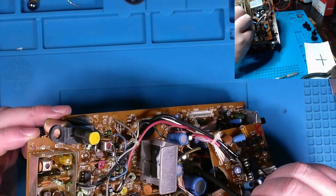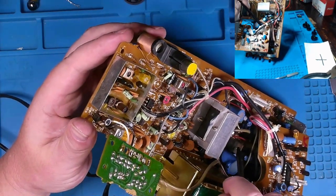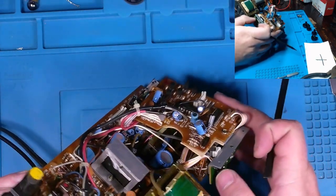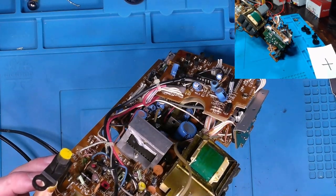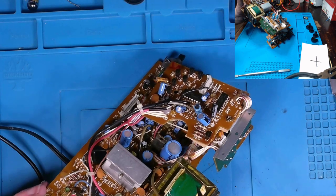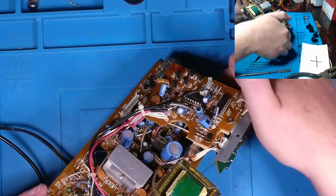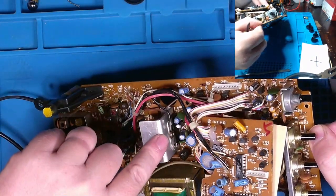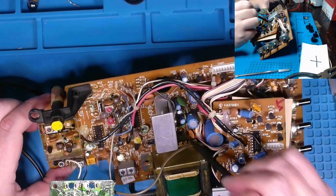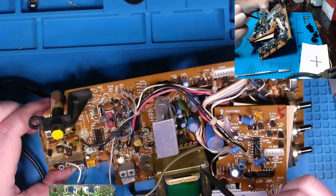Here goes a B507. I believe that is going to be a PNP transistor sitting right down in here. Let me see if I can get this without a shadow on it. Can I get a light over this guy a little bit better? Maybe not. There we go. Angled right now. There goes that one transistor. Like I said, this entire IC sitting here is most likely handling our audio amplification. It looks like we have some form of rectifier here, because I see AC written on both sides. I see a positive and a negative side, and it has D for diode above it, so I assume that is a rectifier.